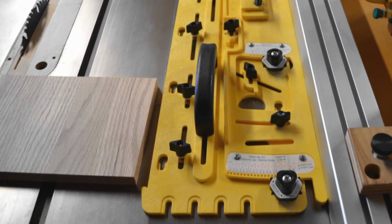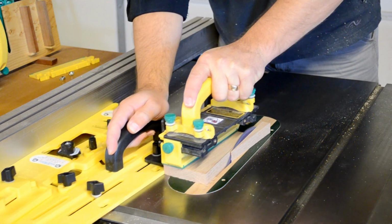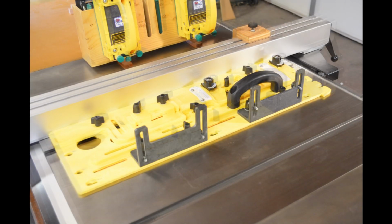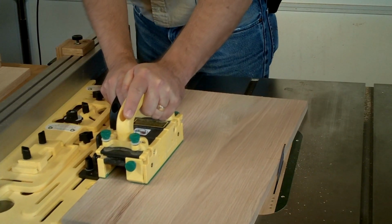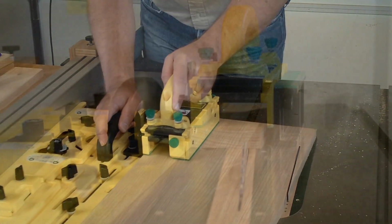While the pusher foot at the back of the jig will guide the part across the blade, it also needs to be kept on the table and against the jig edge. So the jig is designed to accept 1 or 2 grippers to help hold parts down to the table and firmly against the jig edge. The grippers can be positioned along the length of the jig as needed.